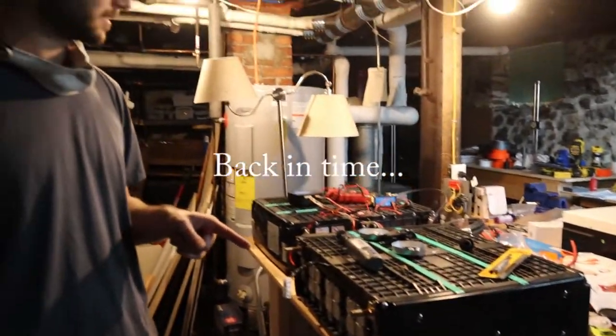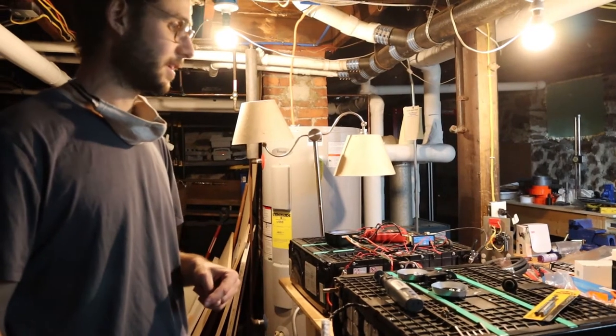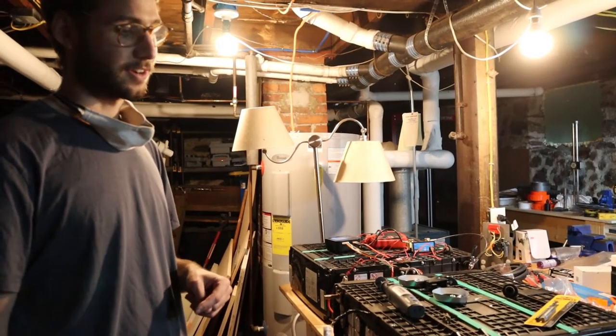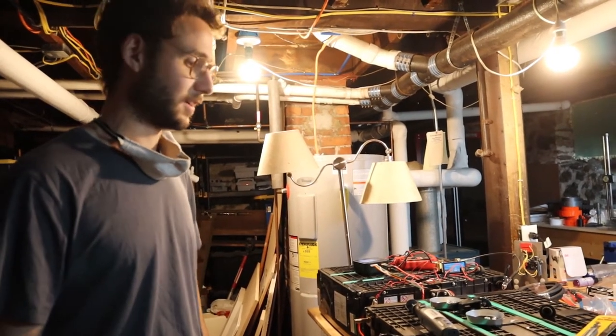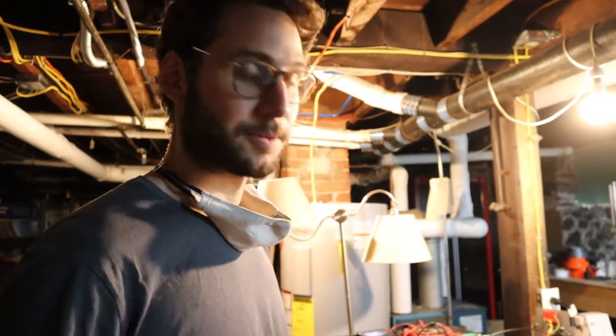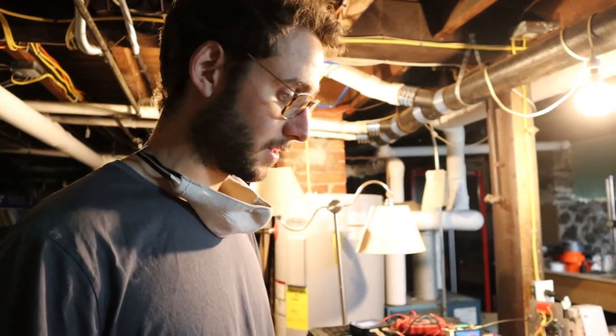What I'm doing is, these are like European-style posts, and there's not really a good option for a typical battery terminal that you see on a 12-volt car battery. We don't really have a good way of securing it to these, so I cut them off, put a thread in, use a screw, and make a really solid connection. So I'm going to be cutting this off.